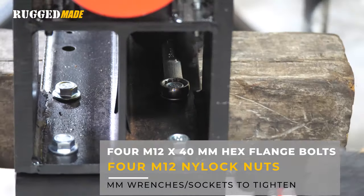Now tighten all of the hydraulic connections. For the swivel connections, you can use two wrenches to prevent the hose from twisting — don't over tighten these. The collar of a JIC 37 degree hose connection should be able to thread on with just fingers before you tighten it. The trick to getting these on is to hold the hose straight, make sure it's aligned, and take any tension off the hose so that the collar bottoms out. If you aren't careful, the hose could be slightly cocked and the swivel gets tight before it's actually bottomed out — you want to make sure that cone and the seat made up properly.